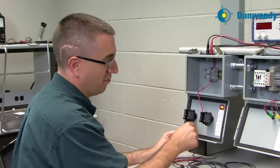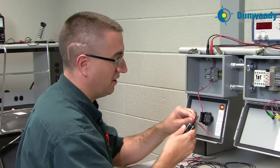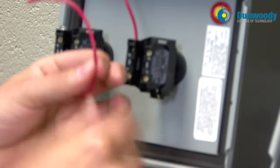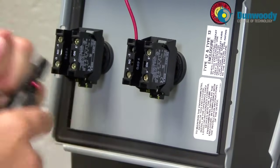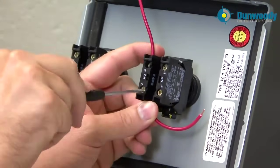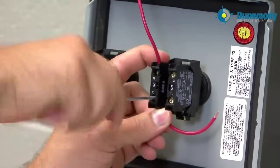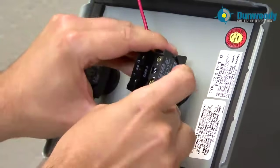I can just jumper from one to the other without having to pull a wire all the way back. So we'll take a wire, cut it to length, and size it up — we only need a small jumper wire. It's worth mentioning that for quality termination you may want to put a crimp connector or some sort of solderless connector on these, but in our case we're just going to strip the wires and go ahead.